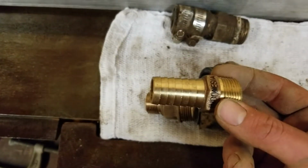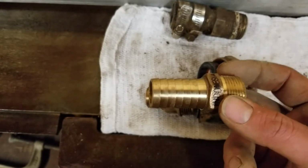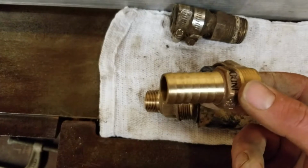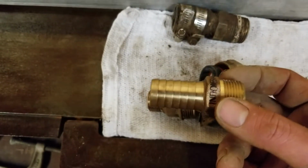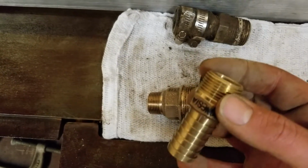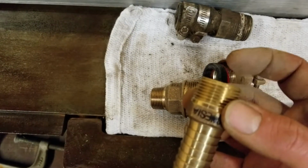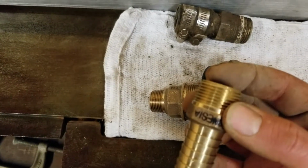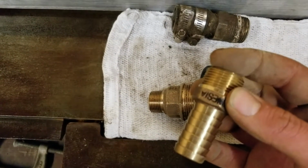And you don't want to heat up the pipe, because if it's an existing water line, you can deform the pipe very, very fast, and you're cutting back more, trying to put it back in. The best way to insert these, in my experience, is to use a mallet. So you'd put this in, tap it in with the mallet. It won't deform the brass. If you use a regular, say carpenter's hammer, you'll tear up the threads.